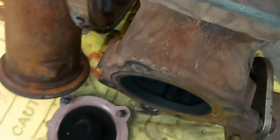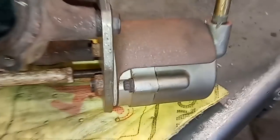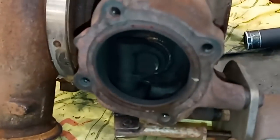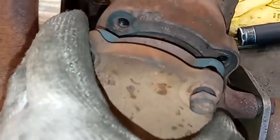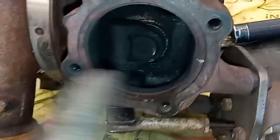What this allows the ECM to control is the speed of the turbocharger, the amount of boost, and the amount of exhaust back pressure — all without having the complicated mess of a variable geometry turbocharger.